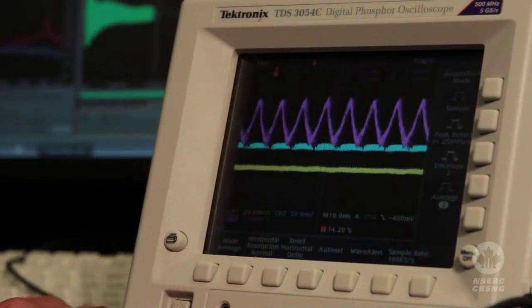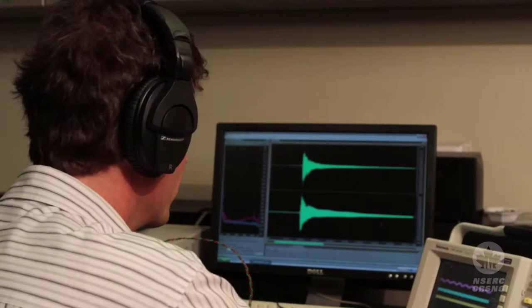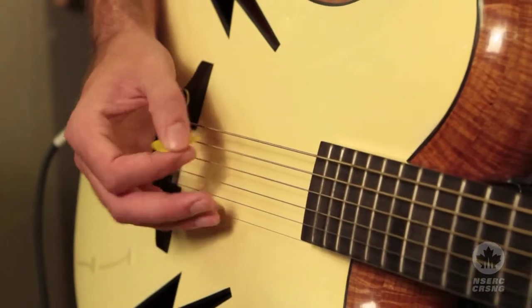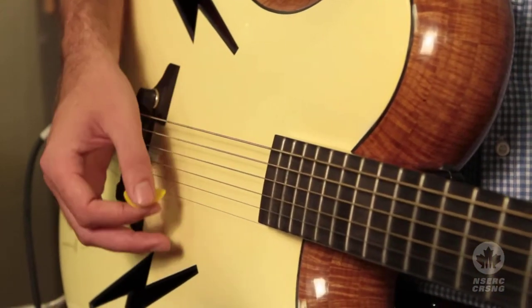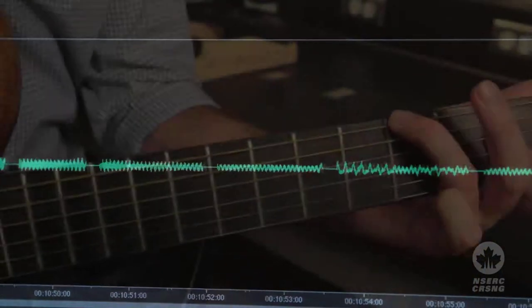They're not supposed to pick up electronic noise or optical noise, because our laser intensity changes and so on. The best way to figure that out is to actually listen to the vibration signal coming out — plugging the sensor into a headphone and just listening. If you place the sensor on a guitar, what you should hear is a really pure guitar sound. Only when our sensor is good enough that it fulfills hi-fi requirements do we know it is really noise free. If it's good enough for a guitar, it's good enough for everything else.